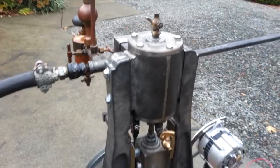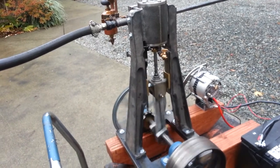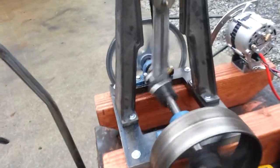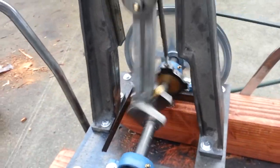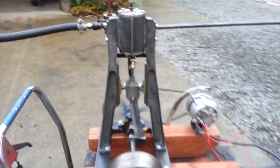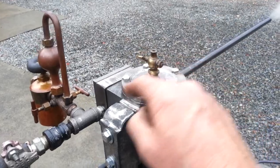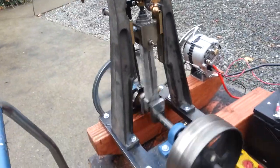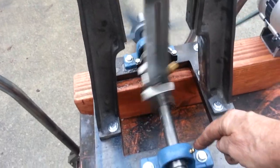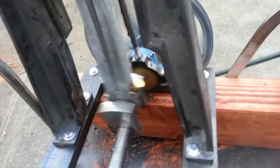Tri-cocks there — I'm gonna open those up when you first start it up to get the water out of the engine. I made all the patterns for this engine and then had them cast at the foundry. I get them and machine all the parts myself. The only things I didn't make are the petcocks and the oiler — that's all antique stuff. There are grease points on there, down here, and on the crank. There are also oil points on the eccentric on the other side.